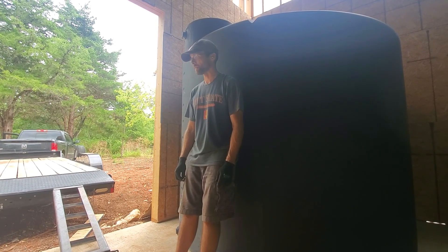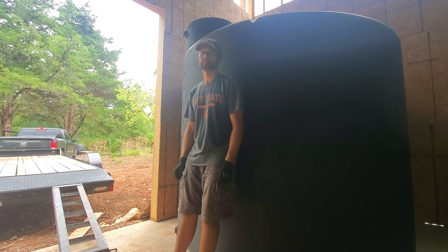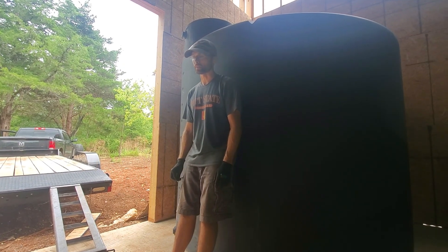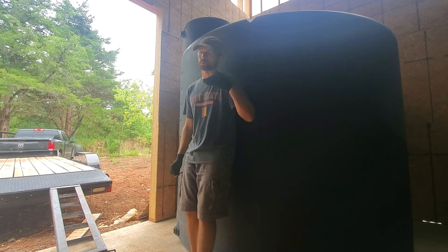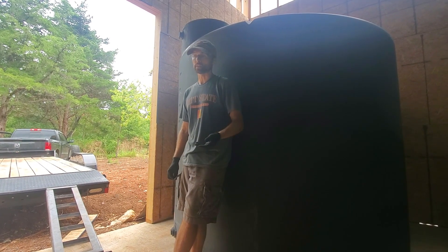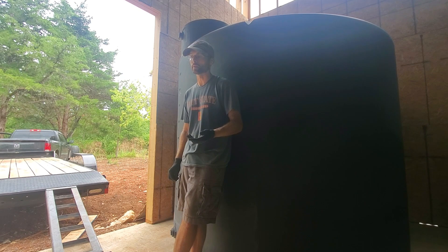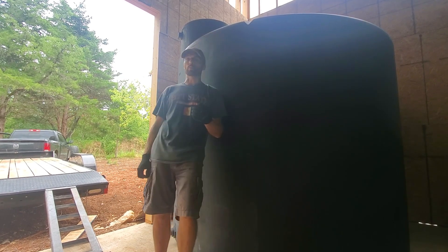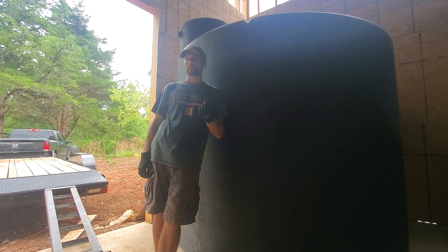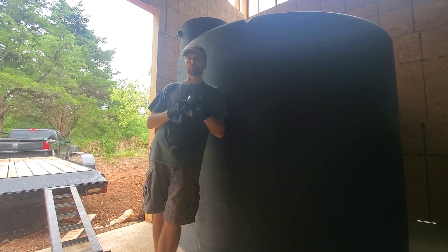What's the most important next step? We need to get more lumber to finish the framing on those windows upstairs. I started framing in the upstairs windows, I've got one more window to frame in, then I have to finish the roof line. At that point I can finish the sheeting, and after the sheeting I have to build all the soffits. After the soffits I can get the roofers to come out and put the roof on. Once that's done I can put the panels on and we'll always have power. Once the soffits are done I'm going to order windows — I'm estimating about a four-week wait. By then we should have the solar panels on, and I can get garage doors on and things like that.